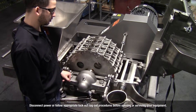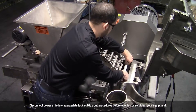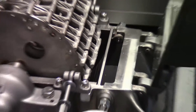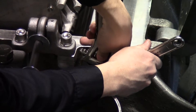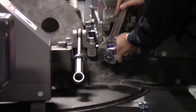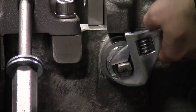The first thing we want to do is remove the dust seal from the opposite of the feed end. This will be followed by the loosening of the four screen cams located at each corner of the screen assembly. In all cases, the cam should be held while loosening or tightening the locking nut.